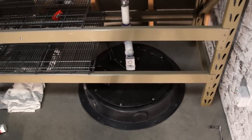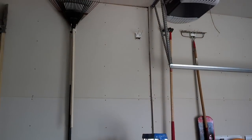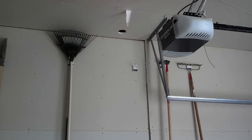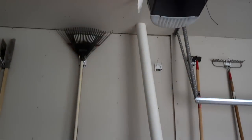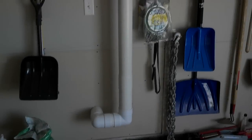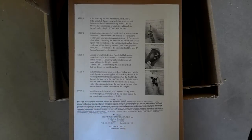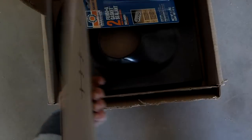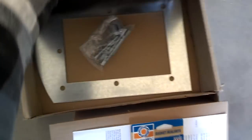So we've sealed the cracks, we've got the sump cover in place, and now we're in the garage. What we've basically done is drilled a hole into the attic space and we're going to put a 4-inch pipe up there. We're PVC gluing these all up. There is the pipe that goes up into the attic right now. I got a boot for going into the roof — one of these cozy boots. It comes with a template, a rubber boot, gasket sealant, and some screws and hardware to mount it. These are kind of nice because they seal in any roof and they seal really well — they're used for commercial applications.